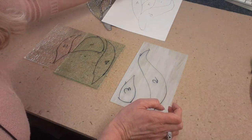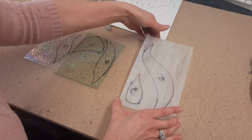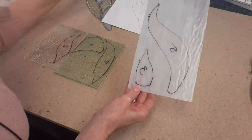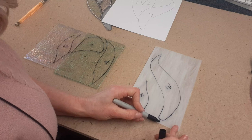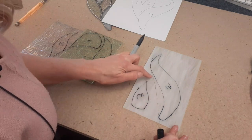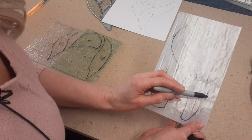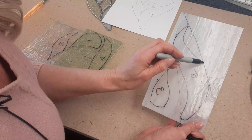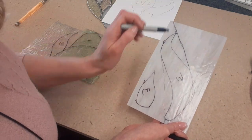This is the part I'm going to show you — how to achieve a good inside cut. On this particular piece, you've got an inside curve here and here. When cutting any inside curve, you want to first cut straight from tip to tip. You are not going to go inside that curve at all — you're going to go straight. Same with the other inside curve: go straight from this tip to that tip. So I'm going to go ahead and get all my outside curves done and not do any inside curves first.